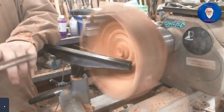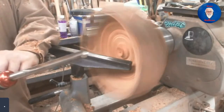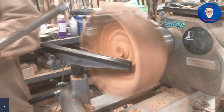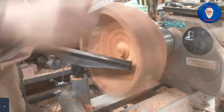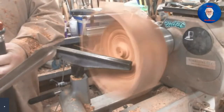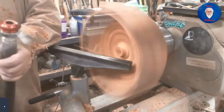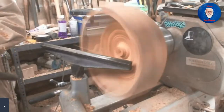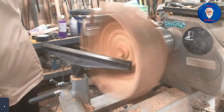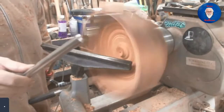It's just that this is a double-ended bowl gouge, so it's still a 45, 45 on the other end, but it's a longer grind, if you see what I mean. I should be able to show you. That one is swept back more than that one. And to finish off the bottom of the bowls, I usually use a half-inch bowl gouge with a traditional English grind on that.